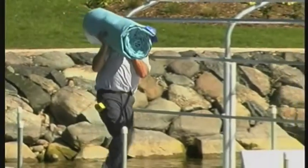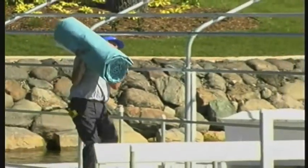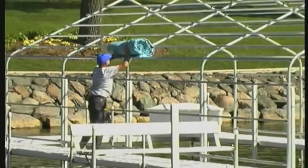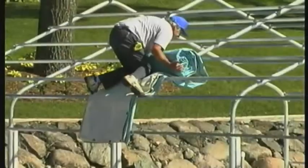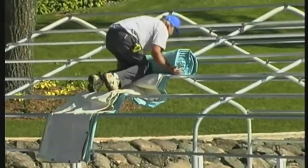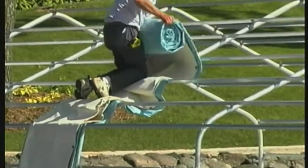The boathouse vinyl has been folded and then tightly rolled so that it can be rolled over the middle bow where the two slats meet in the middle. Place the folded vinyl on the third slat up, then start to unroll it. As you unroll it up the boathouse and over the top, be aware the vinyl needs to be pulled down within approximately 10 inches of the canopy brace pipes.